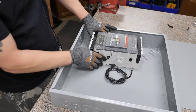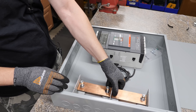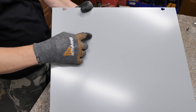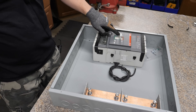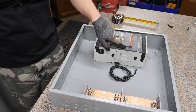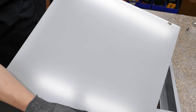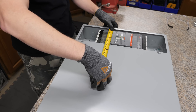That's going to go somewhere right there. Bus bars are going to go right in here. Once I get that centered, I can mark a hole on the front cover here for the 300-amp shunt trip breaker. And I am going to have to shave down a little bit of the plastic on here — if I don't shave that off, the top cover is going to bow just a little bit. So two inches from the side.